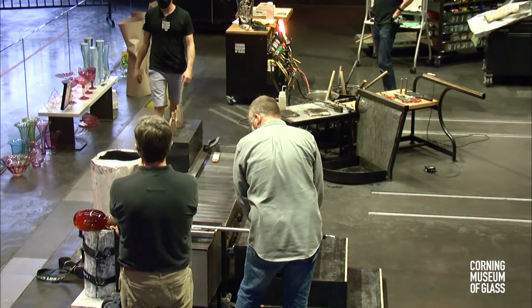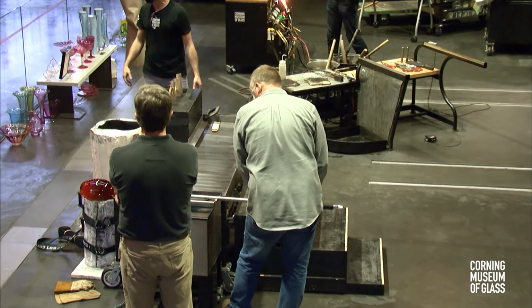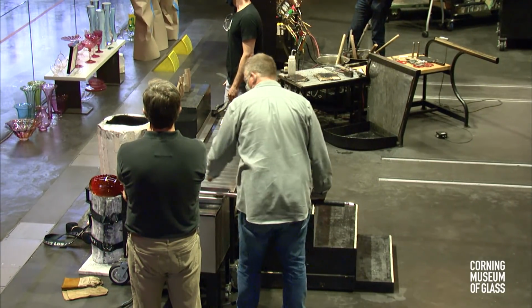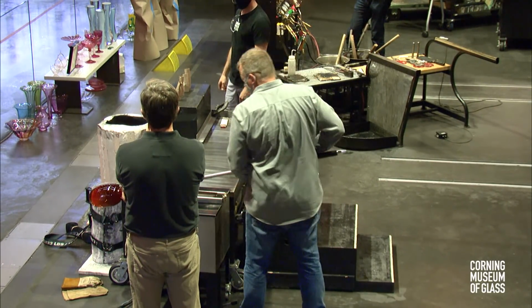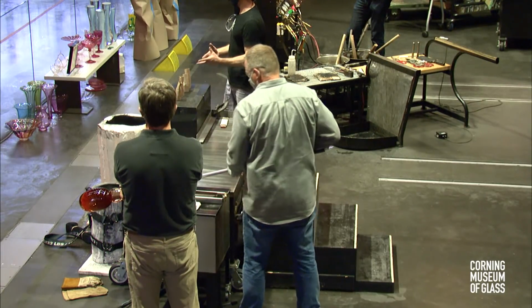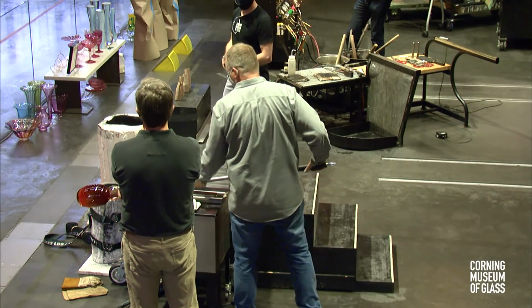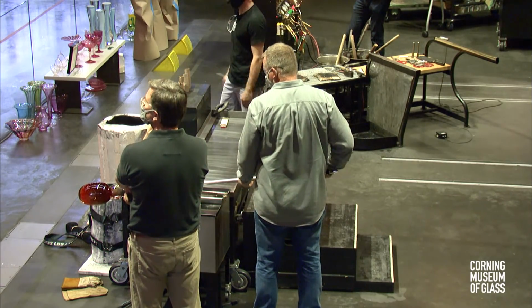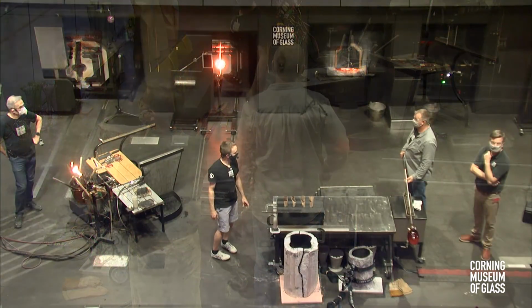So in the process of forming glass, there is some scrap material that's produced, and that just generally gets tossed. You can remelt the scrap glass, no problem, but with all the color that's been mixed in, we won't repurpose this, or we won't use it for what we have here. That furnace is full of clear glass, and we don't want to put any color in there. It would contaminate it.